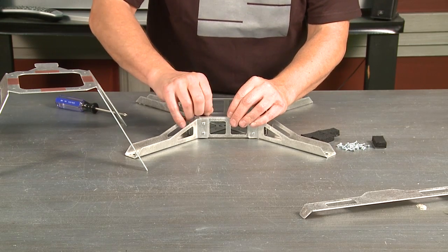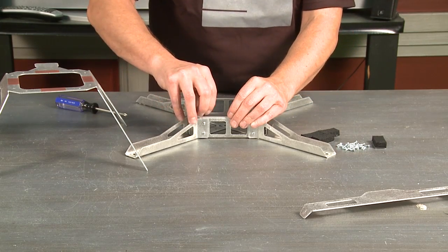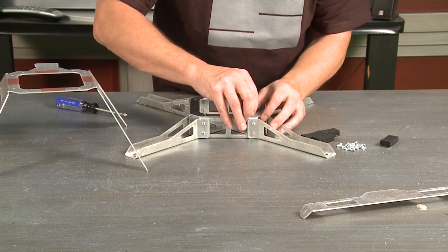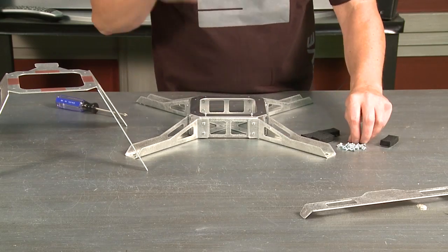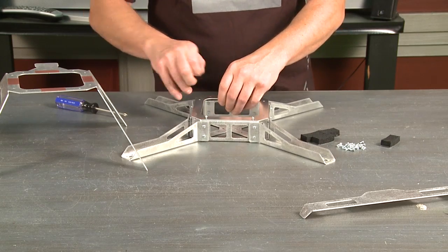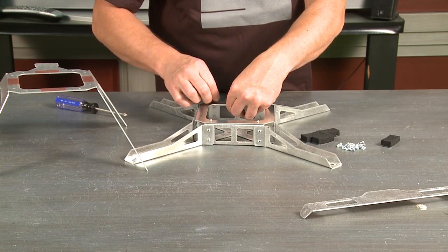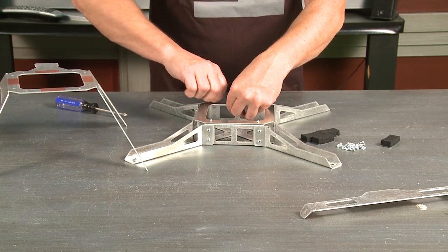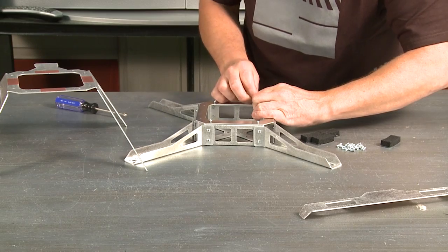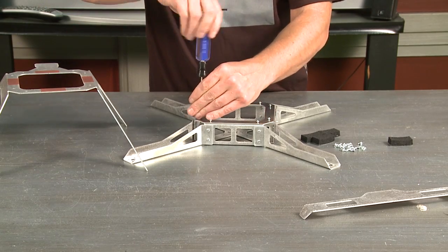This may take just a little bit of tweaking. It shouldn't be too hard, but there's going to be a little bit of a massage that you're going to have to do to this frame, because it's kind of bent inward right now the way that it's supposed to, so that when you're tightening these and actually start to form this frame, you're going to need to push on these things. I'm pushing out on this back wall and pushing in on this to line up that hole so I can see it. It's not terribly hard.